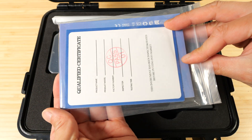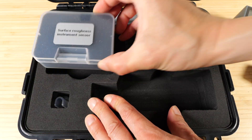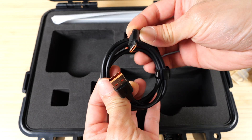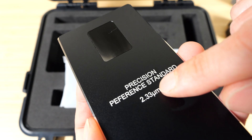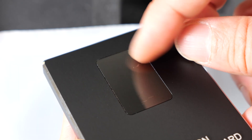User manual, QC card, the tester right here, an AC adapter, surface roughness instrument sensor, a little plastic guard, USB-A to USB-C charge cable, and there is a precision reference standard plate. This is 2.33 microns. It feels fairly smooth, but there's a light pattern to it.